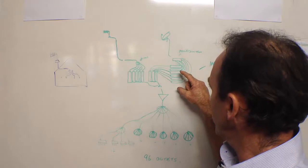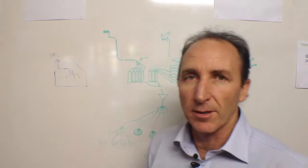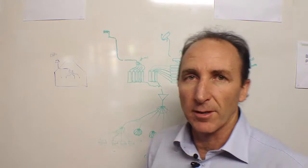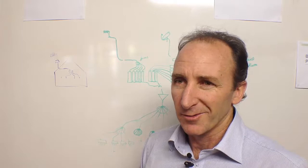It's a very simple way of doing it. The six Foxtel boxes sit in a rack and these three digital modulators sit in another rack with the rest of the head-end componentry. This sort of equipment, while it's not cheap, is very integral to getting a good signal through a camp or through an MATV system. There are cheaper ways of doing it, but you don't get a very good picture and you end up with a poor picture at the end product.